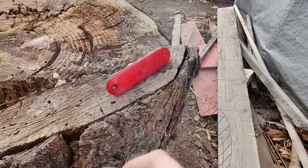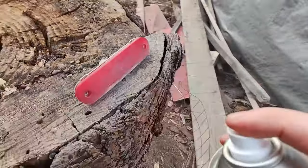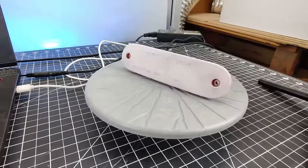That's not too much of a problem as long as you have something like this 3D scanning spray. It works like a spray paint almost, but it's temporary and goes away in about 5 hours. It leaves a matte finish on the entire part, making it really easy to scan — and the scanner has no problem picking up the part now.